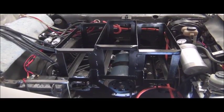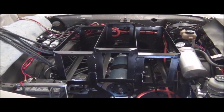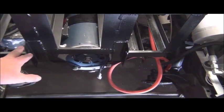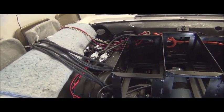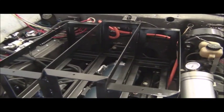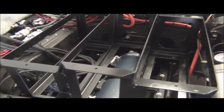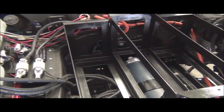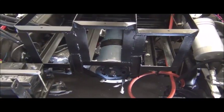Here it is with the front main battery rack in place. There's still the small front battery rack that goes in front and mounts there. We've connected the motor-to-controller cables prior to installing the rack, just for ease since it kind of sits on top of things — made it a little bit easier to do it in that sequence. Next, we'll be installing this front battery rack section.